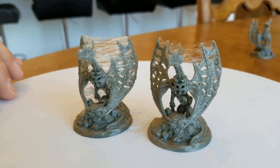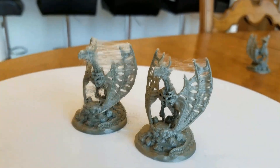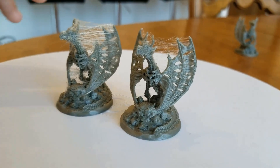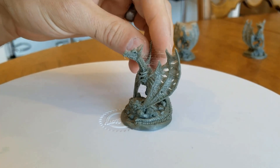So I would say the settings overall are better, but at the small layer height there's just too much stringing. I would say with the new settings, printed at 0.1 height, it looks great. It looks better than what I did with the 0.05 height with the old settings.